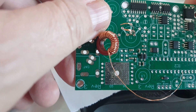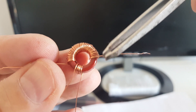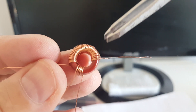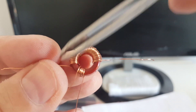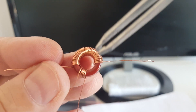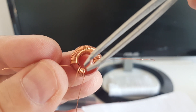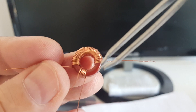I know it's going to work. Here are my 38 turns — that's the beginning of the winding that comes on top of the toroid. I went this way, 38 turns, and it comes out under. Now I did my five turns here, making sure that I was winding in the same direction: one, two, three, four, five. And I have two more to do — twice five turns the same way. And here it is.